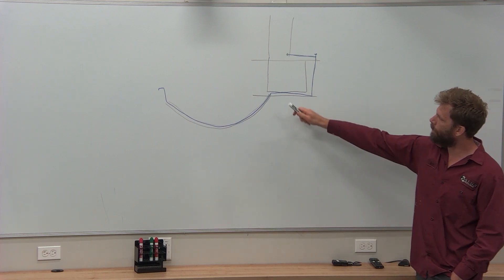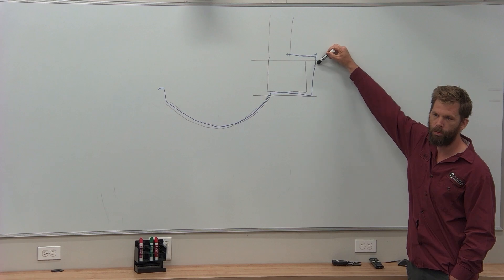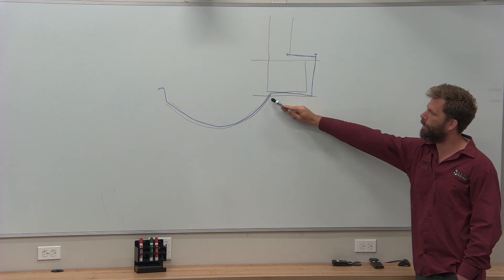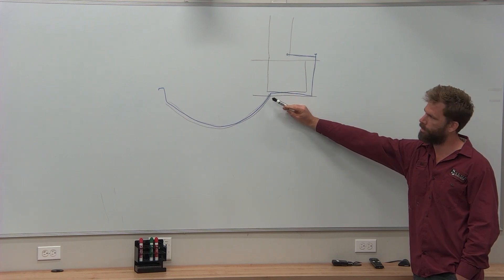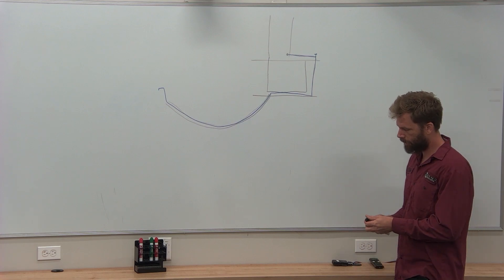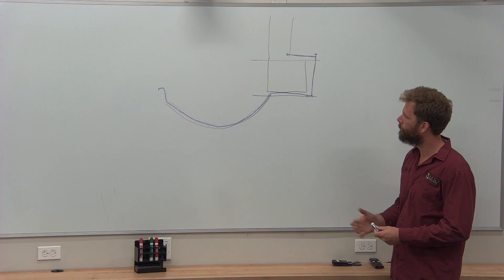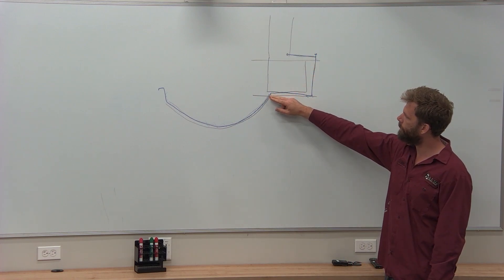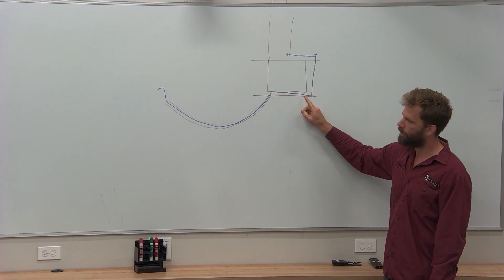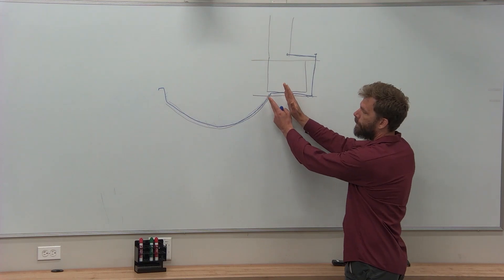What happens is it's usually all exactly as it should be, but the last second when we're installing our air handler we need a better pitch right here, so we push the T down. Then we attach everything, and in doing that we push this 90 down to the concrete, which is typically a little bit lower than the joint — because our joint comes outside of the chase above the concrete level. So sometimes you can have a nice clean drain, but other times not. This fills up with water all the way through, then it fills up with water, runs, turns off, drains, and sits here and here. The next time it runs, it starts pushing against an air pocket right here, and the air pocket is lighter than water so it doesn't go underneath and push its way out of the chase — it just gets stuck and the water backs up against it.